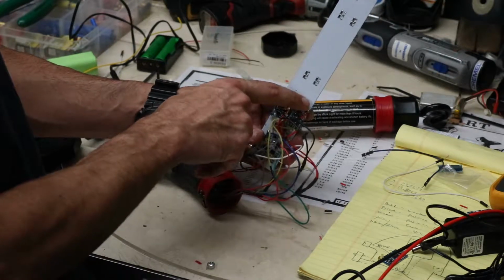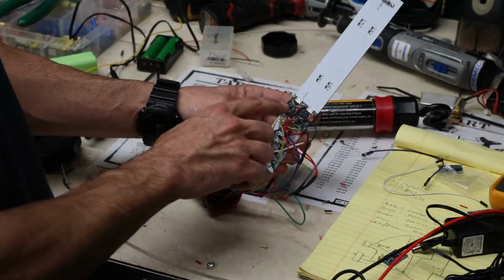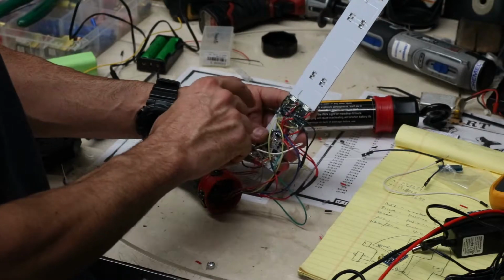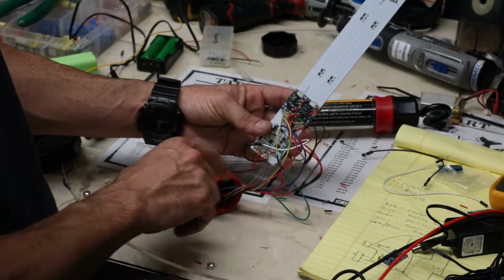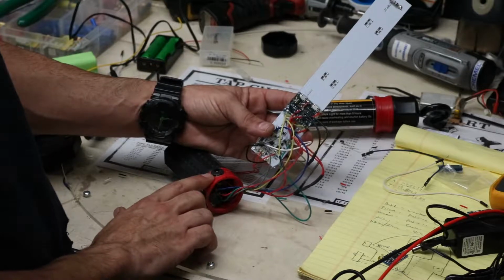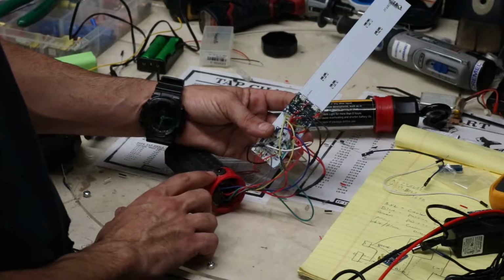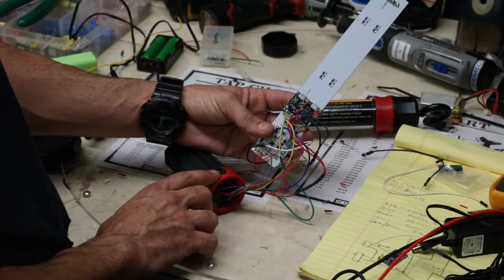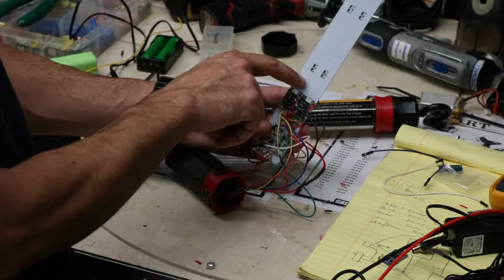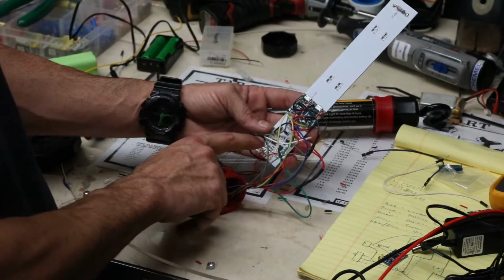So each of these 18650 chargers has the power inputs for the negative and positive on each side of the USB port brought down directly to the charging port. The center pin is positive, the outer ring is negative, so it goes straight from this charging port to the power inputs on both boards.